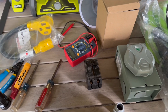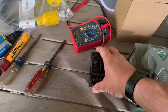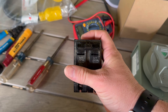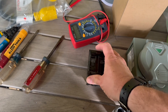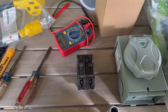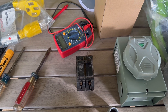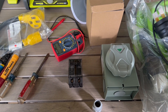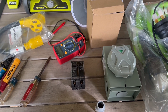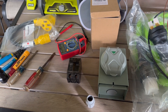One important thing I do not have here yet is an interlock safety device that will prevent you from turning on the generator breaker if your main is on. This is critical — if you have generator power going through your system and the main breaker is on, you will actually send current back through the utility circuit and could shock or kill a lineman working on the pole who thinks the power is out. I'm going to make an interlock myself out of sheet metal. These are also available on Amazon for about 30 bucks for various breaker panels.